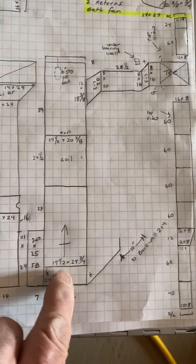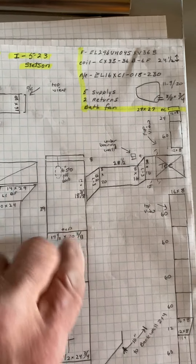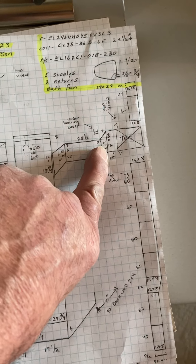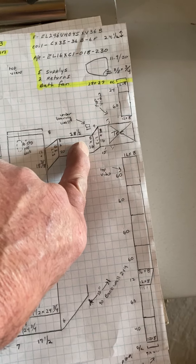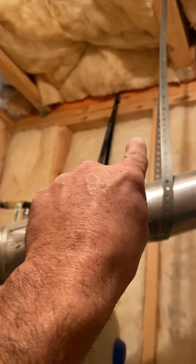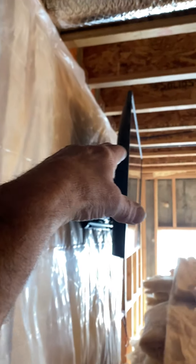Return air will be tight against the wall, and the duct is just as shown. The furnace will sit on a base — furnace coil, piece of duct, and I have the starting collar. Then you're going to come through the wall and go under that bearing wall right there unfortunately. When you get through that, there's a 3-inch offset that'll offset it up.